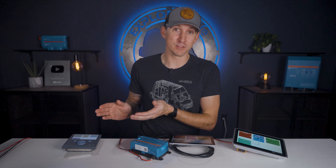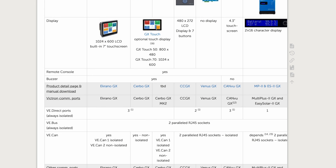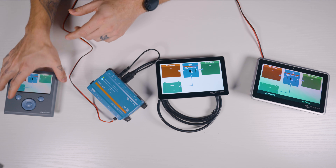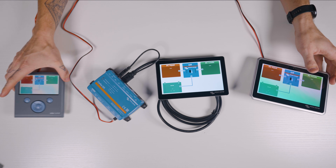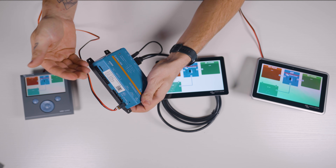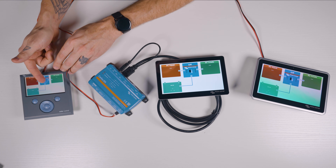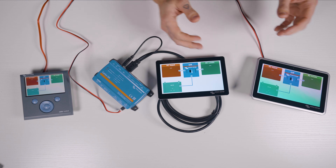On the more nerdy and technical side of things, there are also a lot of differences — though we won't cover every single one since Victron already has a great chart that breaks them down perfectly. For example, the Color Control only has two VE Direct ports on the back, where the Cerbo and the Ekrano have three. The Color Control doesn't have Wi-Fi built in, where the Cerbo GX and the Ekrano GX do. All three units have different configurations on their available programmable relay ports, tank sensor inputs, temperature sensor inputs, and digital inputs. When paired with an external USB hub and VE Direct to USB adapters, the Color Control can handle up to five VE Direct devices, the Cerbo can handle up to 15, and the Ekrano can handle up to 25.